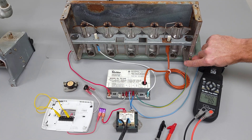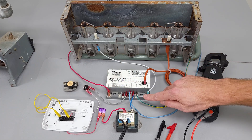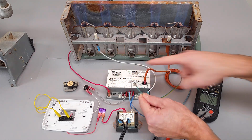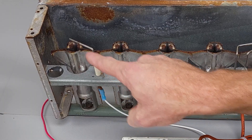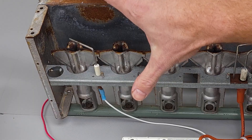You always want to make sure that you have a good ground on your combustion chamber and that this is tight onto the ignition control module. Another thing that could happen is your burner tubes up top could be rusty, and that could be stopping some of the signal from getting through. If you have a low microamp signal due to a rusty burner head, or maybe the flame rod is melted, burnt, or has carbon dust on the outside of it — that's a problem.